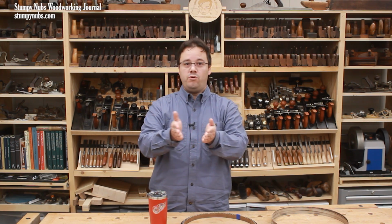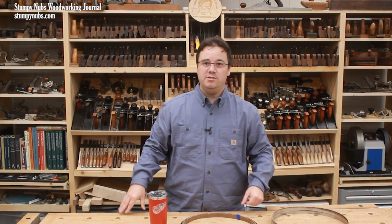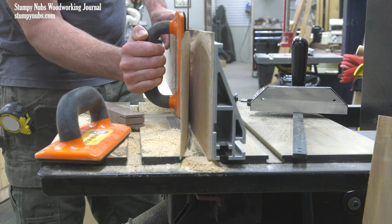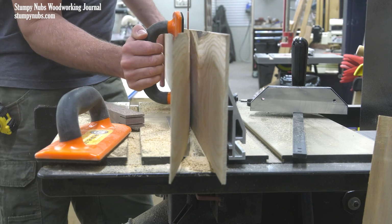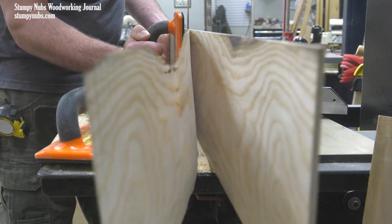But as the blade dulls, you have to do more steering. Now you're lucky to get a couple 1/4 inch slices out of your 3/4 inch board. That can make a big difference in your project, let alone if you need thinner slices for veneers. How do you cut a 16th or an 1/8 inch veneer if your blade wanders plus or minus a 1/16 of an inch?